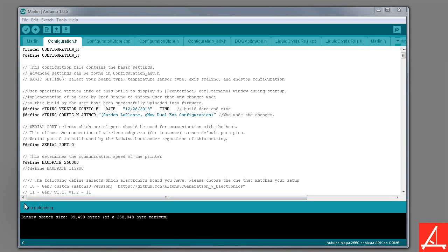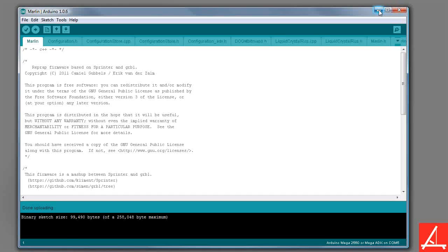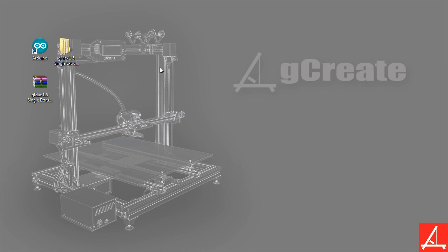That's pretty much it. The actual firmware is now on your printer and you should be able to use it right away. The reason we wanted to show you how to use it through the Arduino environment is that you can actually see and edit the actual code if you would like to. You can also upload the firmware through Pronterface or Repetier Host — there's a lot of different host software where you can upload your own firmware, but you can't necessarily edit the actual code or see what's going on. So it's just nice to know what you're uploading, and if you ever want to tweak the settings, they're all here. We hope you found this tutorial to be useful — if you have any questions or if you like it, shoot us a comment or give us a thumbs up because we want to do more of these. Hope you enjoy and happy printing!